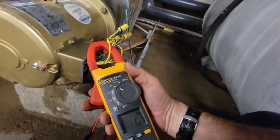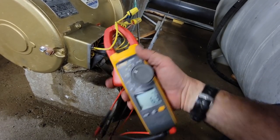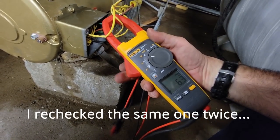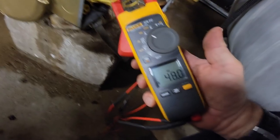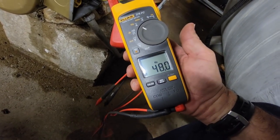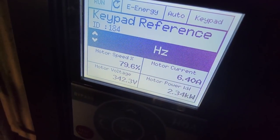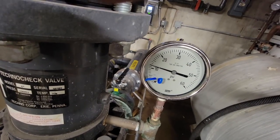Wow, look at that — it's not making a hell of a lot of noise. It says we are running 6.29 amps at 48 hertz. Let's go verify that with the clamp meter. Reading 6.1, 6.3 — fluctuating right around 6.2 to 6.3. Let's check the frequency: 48 hertz. Like to see your cheaper meters do that. We are building pressure — look at that. Happy days!